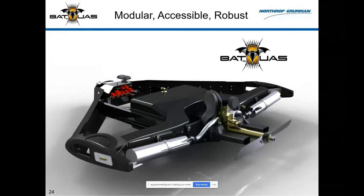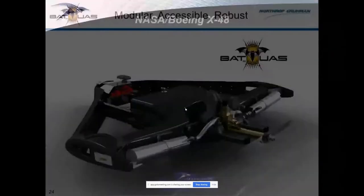In this case, the vehicle management box, some of the heavy stuff was nice to have in the front for balance. There's other benefits too. This stuff was nice to have in the back because it was hot and stinky and messy. That was good. You can also see here that the wingtips, oh wait a minute, our wingtips came off, and we had these little pucks in here that were frangible in case something broke. So the airframe wouldn't break if I had a hard landing, and the wing wouldn't break. There'd be a little replaceable puck here on the top and the bottom. Here you can see we had a blind mate. We'd mate the outer wing on. It would plug right into that multi-hole connector. These are all things just to make it more useful, more idiot-proof, and flexible for people who aren't idiots.